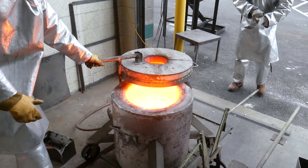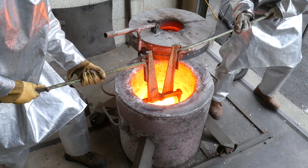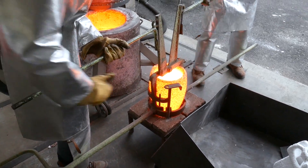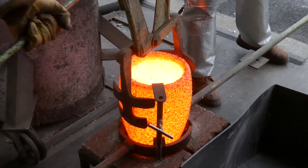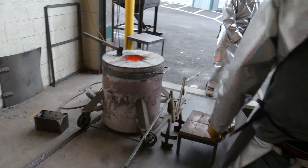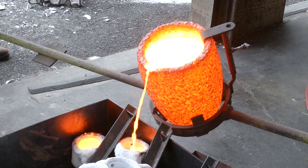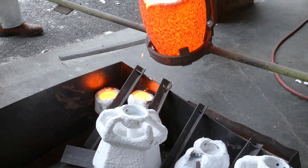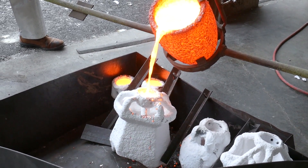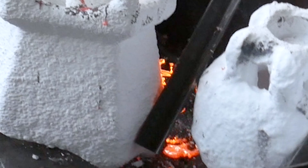This is the final step in this magic trick. This is the gas furnace which has been melting bronze ingots for a few hours — the temp is up around 1900 degrees to prepare the molten metal. It's quite the process to get this far and this is where you pray to the foundry gods that you did everything correctly. There really is no turning back — this is the last chance for a catastrophic failure: exploding shell, small leaks or cracks, or the metal being too cold and solidifying before it fills the entire shell. We had a tiny little blowout on a shell and I had to drop the camera and throw sand at it to stop it from spraying out. A lot of times people pour into covered sand beds where the shells are completely covered in sand, but we pretty rarely have issues like this — you just cover it with sand and it seals right up.